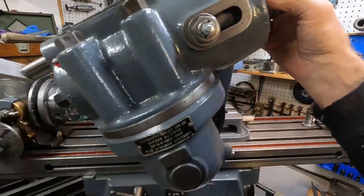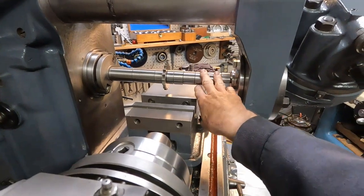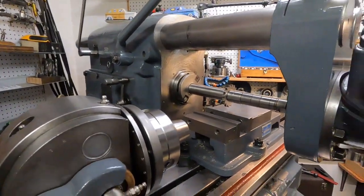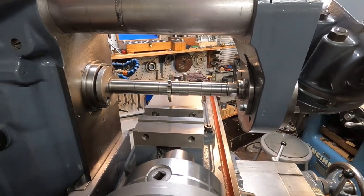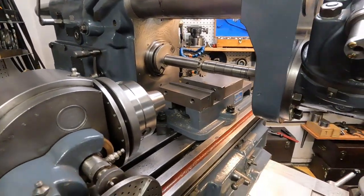So the vertical head here can be taken out and the spline would drive it, and it can be slid. That's the unique thing about this. They replaced this with the Brown and Sharp Number 20 Range Master style with the sliding head mills - those are really rare too, like omniversals, and when you do find them they're usually totally worn out. They took this idea a bit further. But for repair work and the stuff that I want to do, this is fine, and it's great that I can switch from horizontal to vertical.